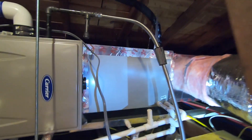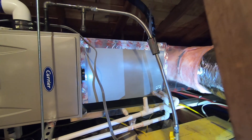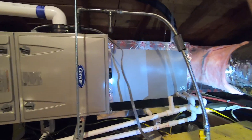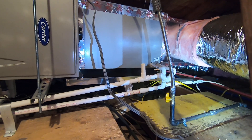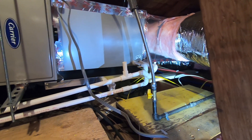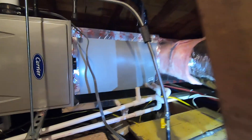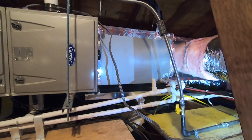On this side we have an ADP horizontal four-ton evaporator coil. The model number is C48H175P159, and it adapts right onto the furnace. Underneath it we have all our drain lines. There is a drain pan with a kill switch, a primary drain, and a secondary drain. The primary goes outside to a pea gravel pit. If that were ever to fail, the secondary drain line drips over a window so you would see it. The kill switch on the pan shuts down the system if any water hits it, so it doesn't drip through and damage your ceiling.